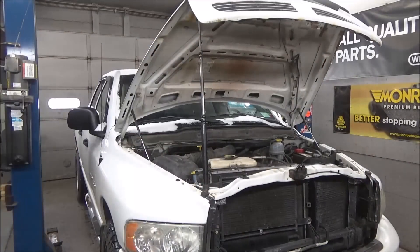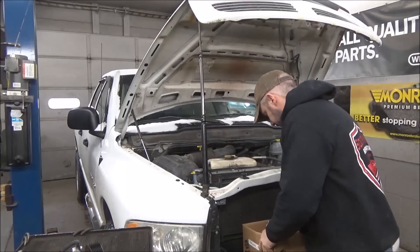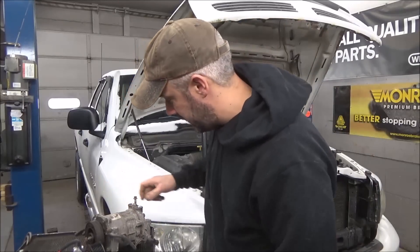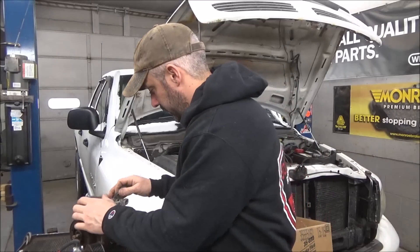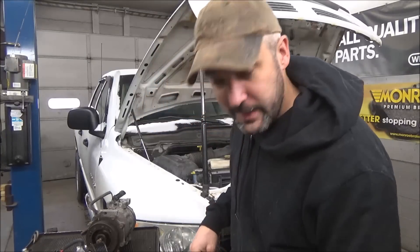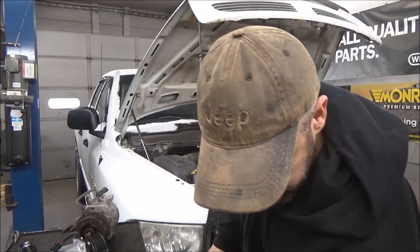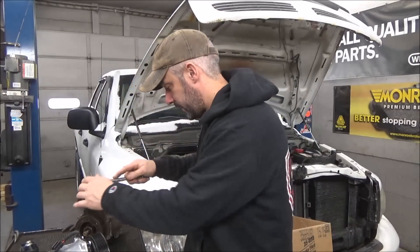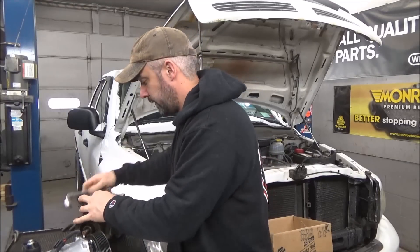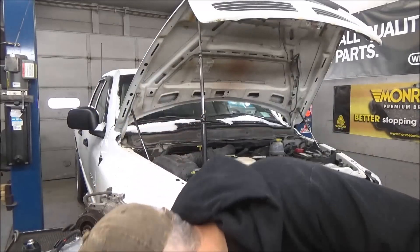I've got the old compressor and the old box of parts here. I don't think we drained any oil out of the old one, so that's one thing we have to do — see how much oil is in this little guy. Of course, we don't know how much was removed from the system, if any at all. Take it, pull the drain plug out of it. If I had done that, I would have written it down somewhere, basically stating how much I took out so I don't forget. I have a tendency to do that, especially if it's been several days.